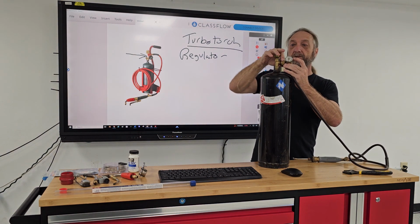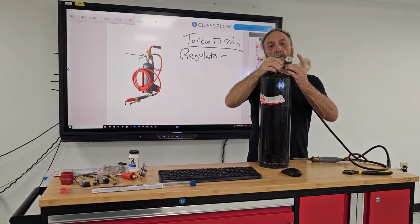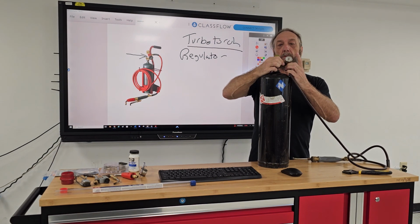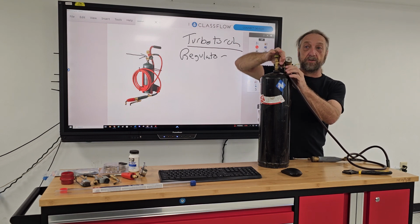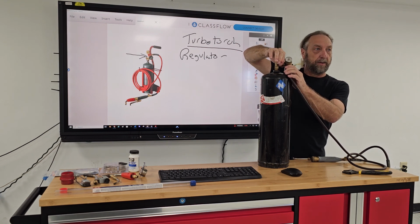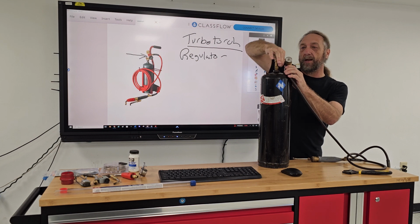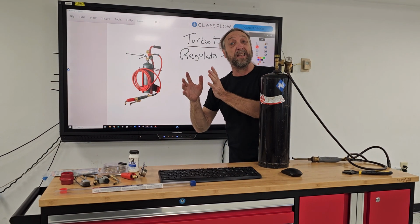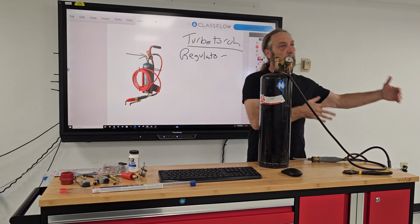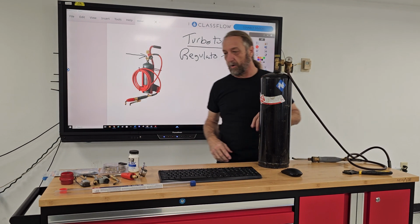Let me just attach it on there. Now, this is regular, what we call right-hand thread, which is like regular righty-tighty, lefty-loosey. But on this one, acetylene is left-hand thread, where oxygen is right-hand thread. We'll look at that in a moment.